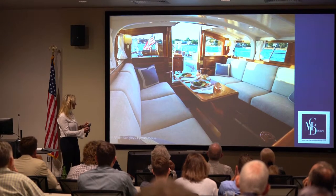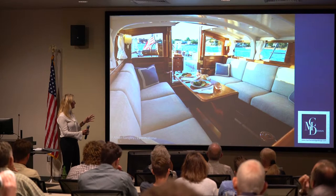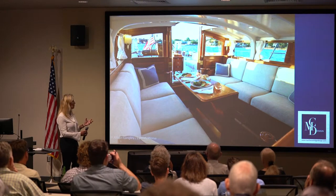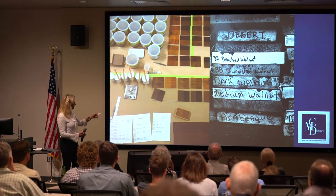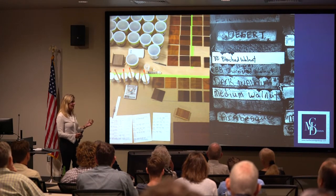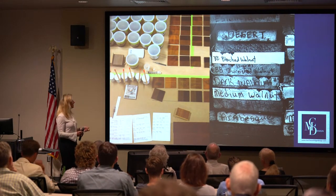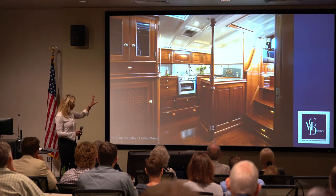Here's the pilothouse all finished. One of the things about working with clients who haven't built a boat before is getting through the idea of what details you can add, while also making sure it has to be refined but also able to take a human body being thrown at it in case you crash. I always start with what's sustainably harvested — and nobody pays any attention to that — and then go into what they really like. We ended up being a teak boat primarily for the joinery, with a walnut sole.